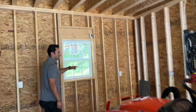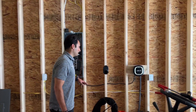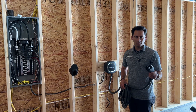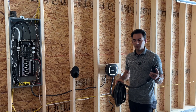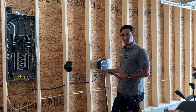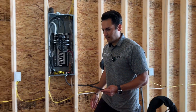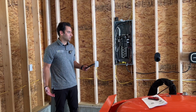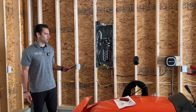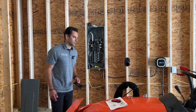Now we'll walk into the garage and I'll show you the wallbox charger. This is a 48-amp wallbox charger — you can see it's got the J plug, and you can get an adapter to plug in Teslas. I use this exact charger for the Cybertruck at my house. It gets firmware updates so it gets better over time. This is the wallbox charger we're using on a lot of our projects — 48 amp is pretty much the max residential level 2 charger you can get. It's this one or the Tesla destination charger.